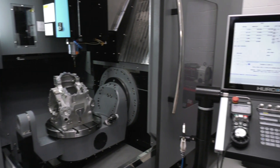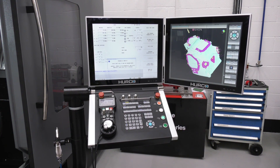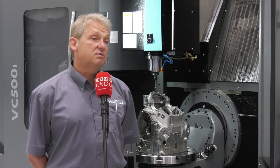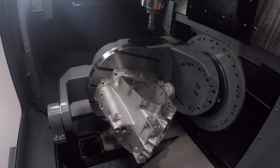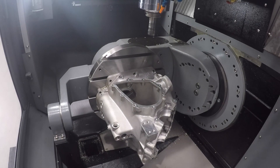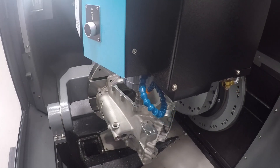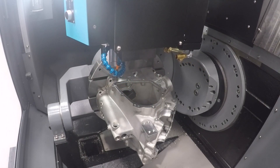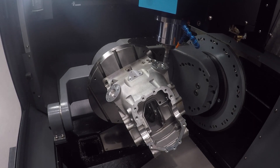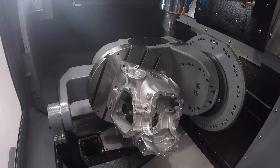What about the actual application that you've got on here? Talk me through what you would be doing on what is a gearbox component. A customer has come to us and they want some reworking done on this — they wanted some helicoils put in some holes. So we've actually scanned this component in just to get an STL model as a reference. We've programmed the part conversationally on the control and we're able to see the machining that we're doing programmed onto the model. We don't create the STL on the machine — it's created by an outside source — but then we bring the model into the machine just as a reference and program it conversationally, so you can see that you're actually machining into the model.